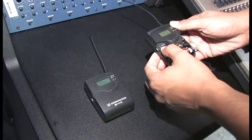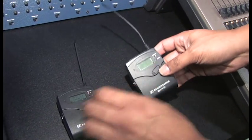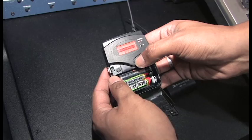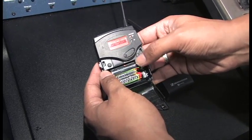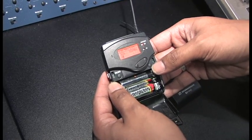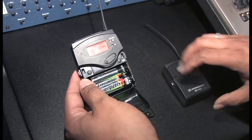The next thing we want to do is make sure that the send unit — the transmitter, the one the anchor is going to be wearing — is off. Over at the receiver, we go down to the menu and go to easy setup, and I'm going to scan a new list. This is going to run through all of its available frequencies and see which one has the least amount of noise, so we can use that frequency to get the clearest signal from the anchor to the ABM unit.